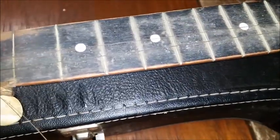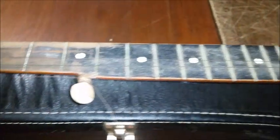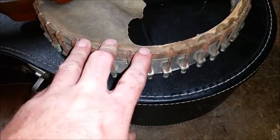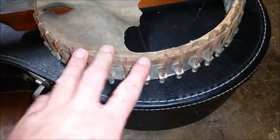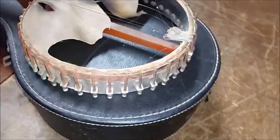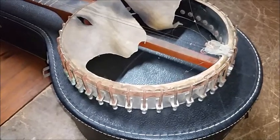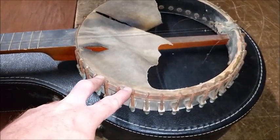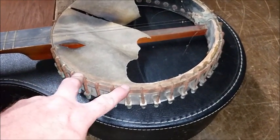The first ring is actually a screw - it's a little cracked around it but I think it should be fine. I'm just going to give it a good cleaning. I'm going to start by removing all the hooks, nuts, and rim - all the steel parts that are rusted. I'm going to use electrolysis on those and I'll show you that process, then I'm just going to polish them really good. I'll see how the rest of it cleans up and whether it'd be worth finding new ones or replating.